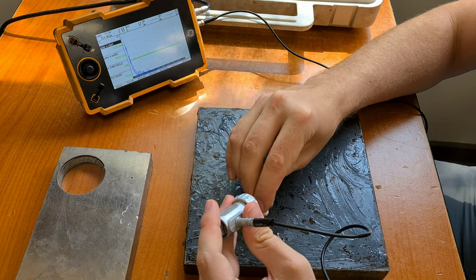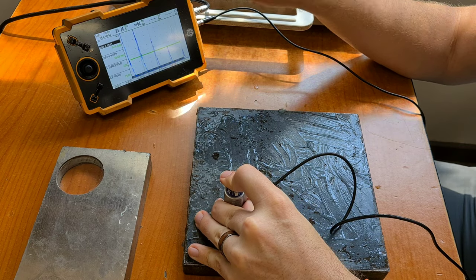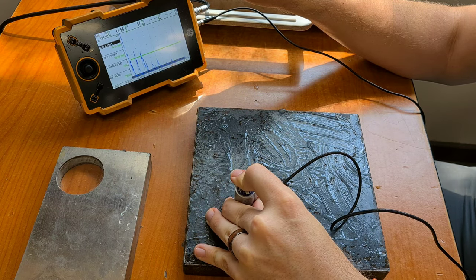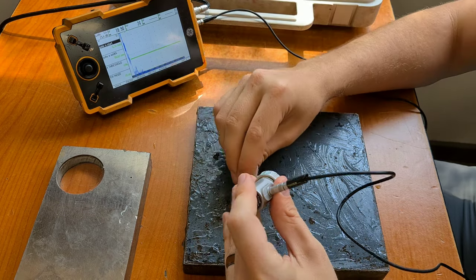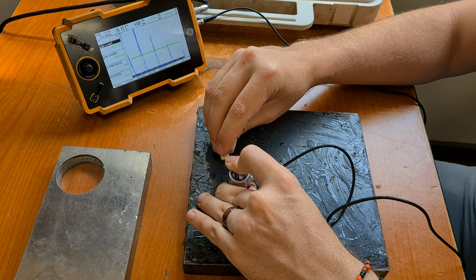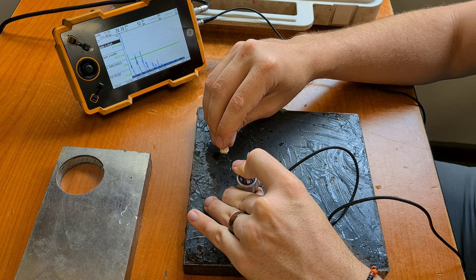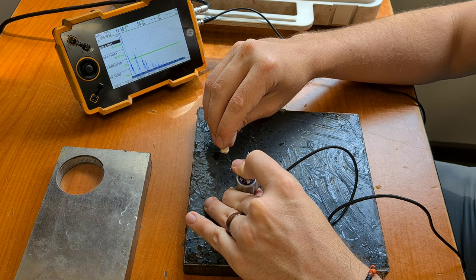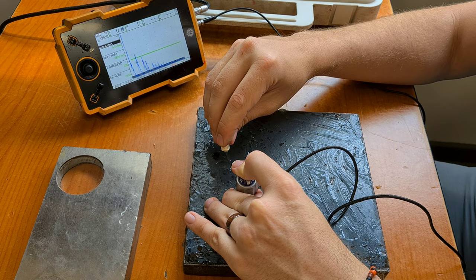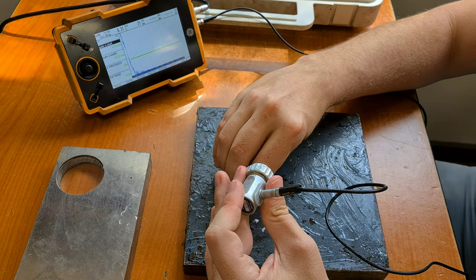It's very important to keep your eyes here and here, so it takes some getting used to. You have your backwall echo — it will drop away, it will pop up. You lift it up in the center and make a little dot. You move your probe a little bit, find the place where they equalize, lift it up and make a dot. You can keep doing this to get the size of the lamination. Sometimes it's a little bit sensitive, so just take your time and make sure there's no probe rock.